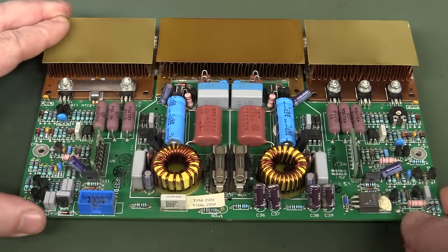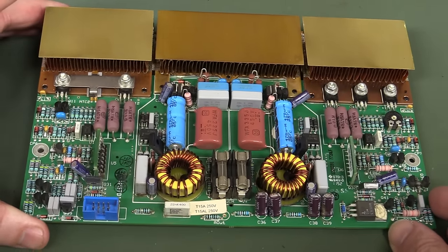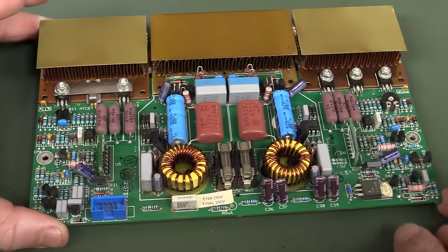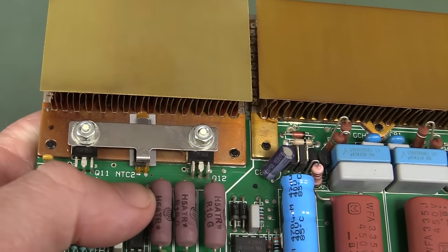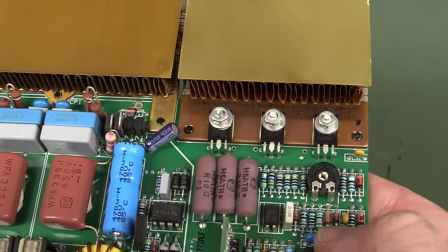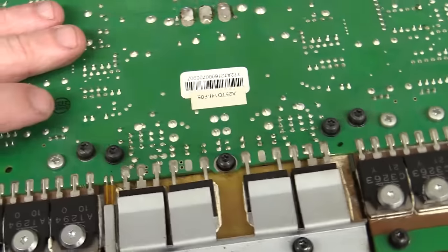I can't see anything really wrong with that. It's quite well made - a typical high quality discrete transistor design. But on this side we have an NTC thermistor doing temperature sensing of that heatsink, while this side has three transistors instead of two with no thermistor. So they're only thermally checking one of the rails - a bit poor.